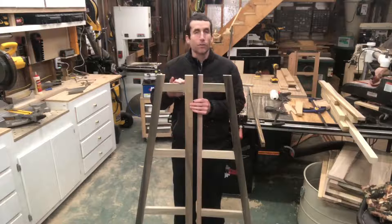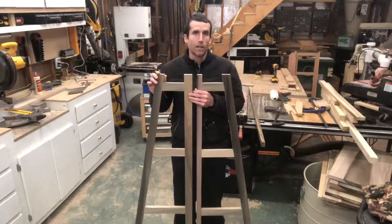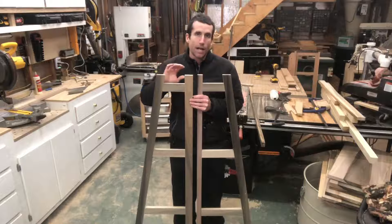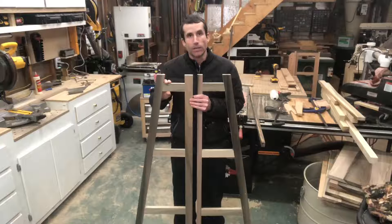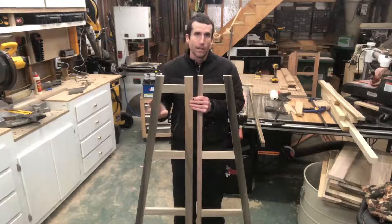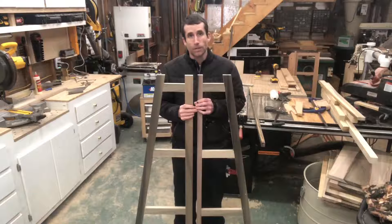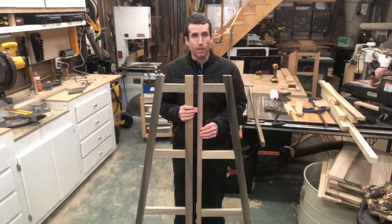All the angles are ten degrees. The first thing I did is I ripped all the strips on the table saw at two inches — or you could even just rip them at an inch and seven-eighths. I ripped them at two inches and then put them through the planer on edge in really long strips and took it down to an inch and seven-eighths. All these are inch and seven-eighths in width except for this narrow one, which is an inch and an eighth.